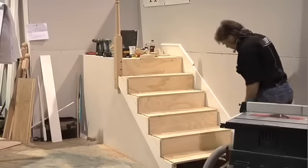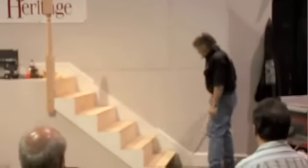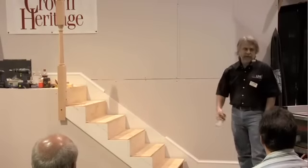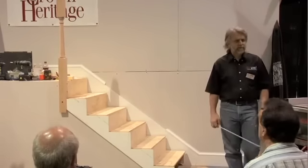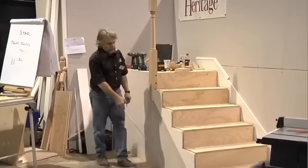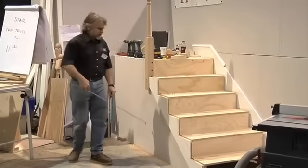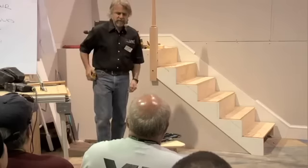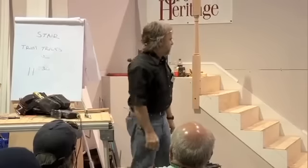This is a miter joint because the molding that goes on top is mitered. I know that the pitch of the stair is 36.7 degrees, so when I cut these miters I cut them at 18.35 degrees, set on my chop saw as close as I could get to that. And my miters are perfectly tight without having to run back and forth to the chop saw. Also, in a stair, if I have a baseboard along here, I like to have the skirt board be a continuation of the baseboard — maybe have the molding turn and come up here. I didn't invent this stuff; this is classic 19th century, 18th century carpentry.